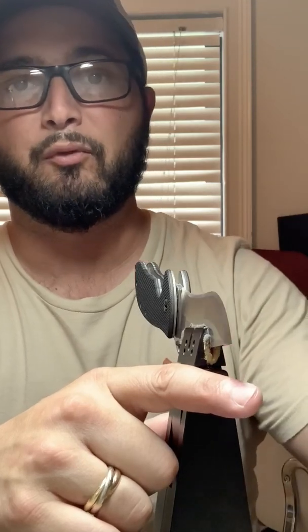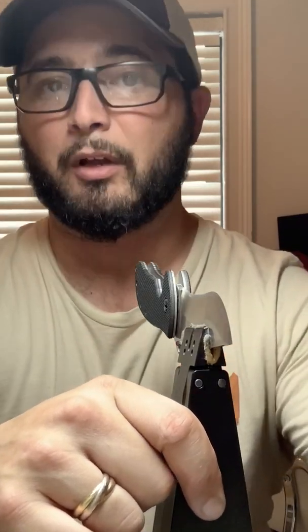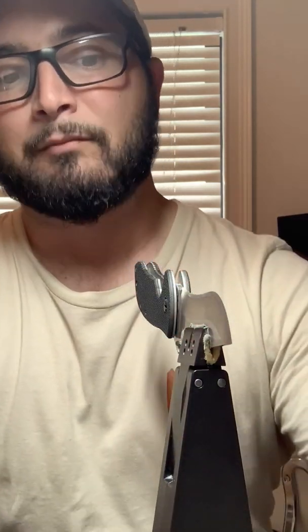We created a burr grinding from this side, so the metal was folded over on that side, and we removed the burr on the back side. So that knife was fully apexed, the knife was fully sharp at 100 grit. We took it to 200 grit, further refining that edge, and it was apexed, continues to be apexed, and it was sharp at 200 grit. At 400, it's all right, it's decent, but 600 is where we would leave our standard sharpening. Then once we move up from 600, it's not that we're making the knife sharp anymore because it's sharp at 600. It's now the mirror polishing. So 800 and 1000 already get a certain amount of polish to them, and they are more refined edges.